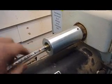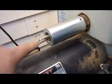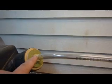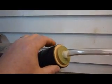Coming out the backside, you can see where the lamp rod is coming out, and I have a 3/8ths ID hose — just again, any hardware store. This is run, kind of coiled around, goes into another piece of MDF turned on the lathe, hole drilled through the center, epoxied into place. The MDF is not epoxied into this vacuum hose — it's just turned with a slight wedge shape so that it fits in there very nicely and tightly. And of course, this feeds to my shop vac.